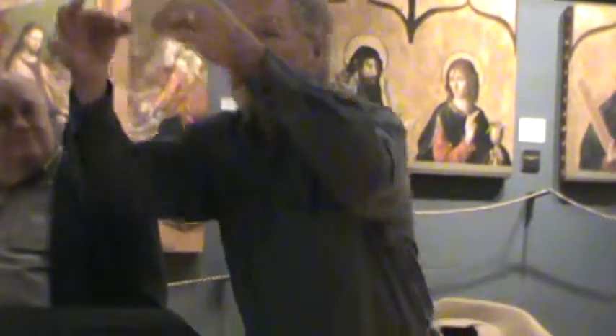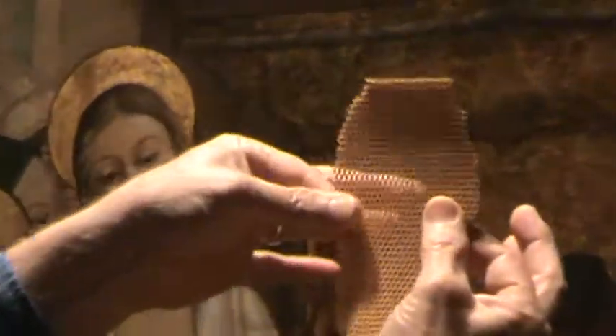There's a space which is filled with this — Nomex. It's a honeycomb pattern. This happens to be eighth-inch cell, about 80 thousandths thick, of paper — phenolic resin impregnated paper. This type of structure is used between two thin layers: an inner and an outer layer. The resultant composite is roughly the same stiffness and strength as that amount of solid wood.